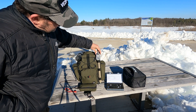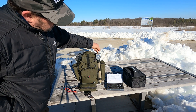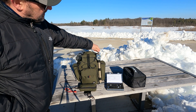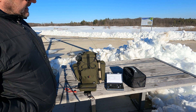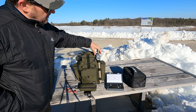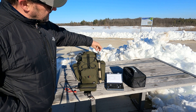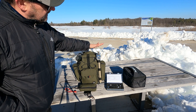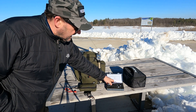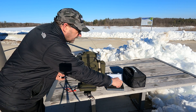For this antenna I've got a bracket I made here — this is the Diamond CRM bracket but I made a mount for it. This was an extender, about a foot long, with a stud on the bottom and a 3/8 at the top. I made it a little bit longer to achieve some resonance. Since I have it on the backpack I can mount a regular antenna using a 3/8-24 CB stud and put any other antenna on it. For this one I've got the SO-239 connector because that is what this antenna uses.